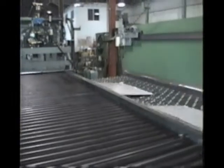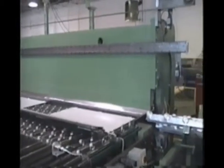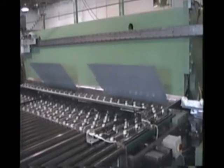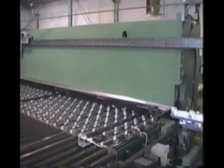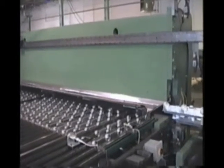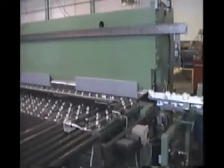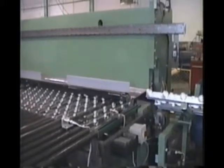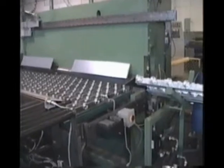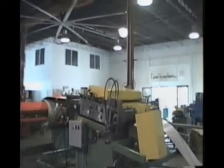The programmable roll feed will sequence the coil strip through a series of pre-tooled knockout, edge notch punch, and cut-off presses. All tooling is set up on adjustable die beds with lead screws and micrometer readouts to accommodate a wide range of coil strip widths and part size variables. Part size variables within a given coil strip width are all completely programmable, requiring no physical changeovers, downtime, or setup. Coil width changeovers are simple handwheel lead screw die settings or infeed guide positions that can be performed in a few minutes. All dies are pre-tooled and require no major setup or physical changeovers.